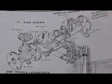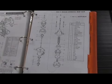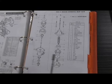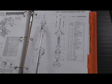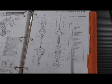The CDHS-14 relief valve had 2 external relief valve sensing lines. The CDHS-14 relief valve, again used on the Model RP, had, and here's a picture of the relief valve body, the relief valve seat which screwed in from the body, relief valve disc holder, relief valve stem. They utilized 3 rolling diaphragms, a small lower one, an upper and lower rolling diaphragm, and the pistons that held the relief valve together. Relief valve spring was mounted on the top. Cover comes off the top like this.